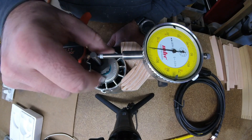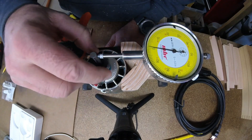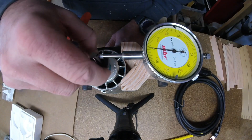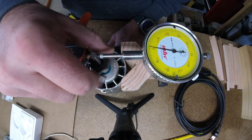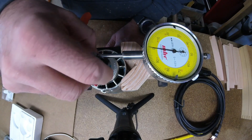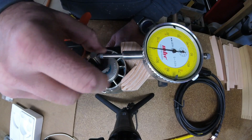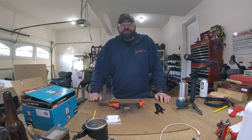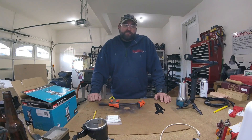That's pretty good. I have gone ahead and ordered a precision collet — it hasn't come in yet, but we'll check it once it gets here to see if it tightens up a little more. Again, this is not precision CNC spindle stuff. This will be plenty good enough for anybody who wants to use one of these on their CNC router table for woodworking and even metalworking. At least we have a baseline — we know what our runout is with that collet in this router with these bearings, which will be useful in the future for diagnosing tolerance issues or determining if bearings are worn and it's time to replace them.